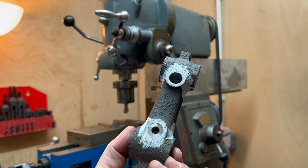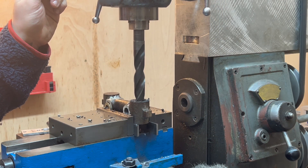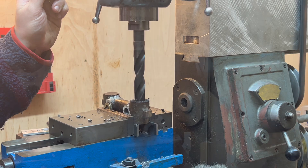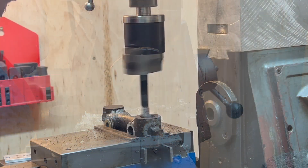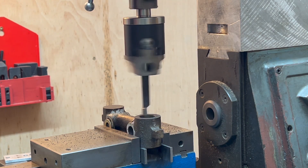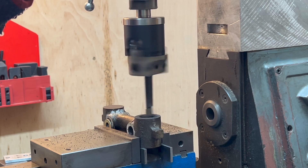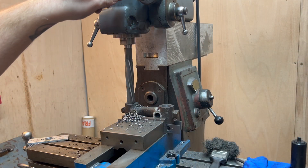Those are for the clamping plugs, and now we've got to sort out the bores for the pillar itself and the tools we're going to be mounting. I always like catching these big drills in there - I think it's very interesting to watch them go. I did finish out the bore on this one with my boring head, which I think is the first time I'm using this in actual anger. On the other side I had a reamer that was exactly correct so I thought I may as well use it.